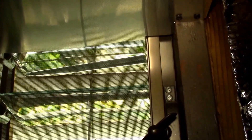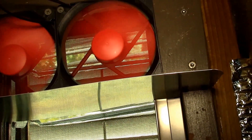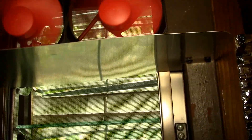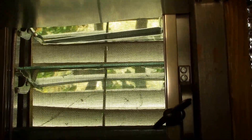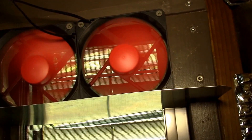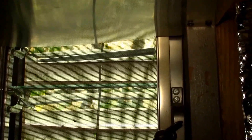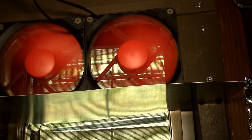I have this wooden frame that fits into the framing around the window. I put an aluminum sheet underneath up to the screen so the air being pushed out by the fans goes out and doesn't get immediately sucked back in, because the gable vent lets air both in and out. I tried to get the fans up high to push as much hot air out as possible, with the area underneath open to let air come in.